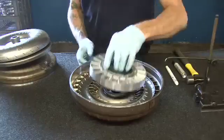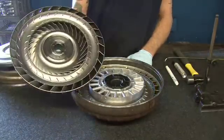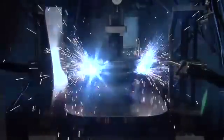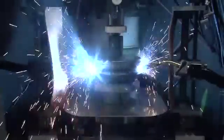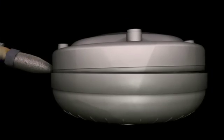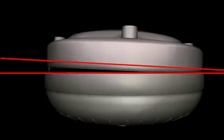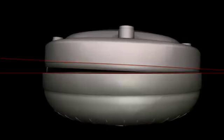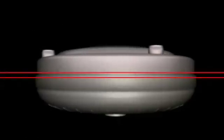Each converter is prepared for final welding using Recon's proprietary processes. Final welding is performed on Recon designed and fabricated machines that weld consistently straight converters from the start of each production day until our entire customer needs have been met. This animation shows single gun welding used by most of the industry, in which the components are pulled out of alignment by the welding process. Recon demonstrates the proprietary dual gun welding process that maintains parallel and perpendicular surfaces by applying equal and opposite welds.